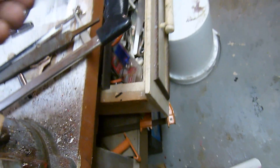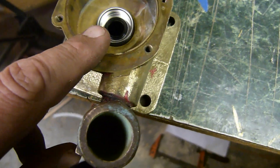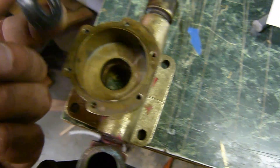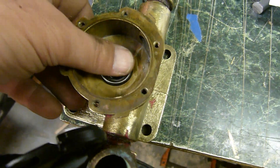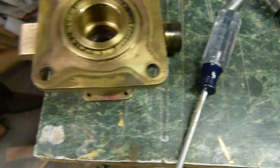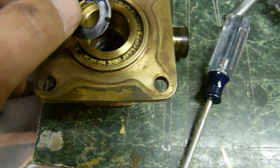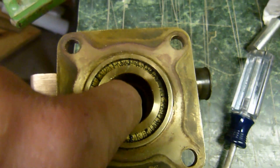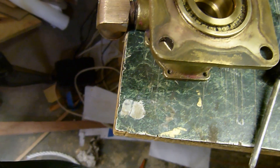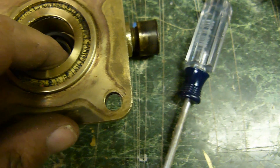Just used this brass fitting stuck in a board and then set a spacer up. I actually made two spacers. Now we're going to insert the seals. Here's the first seal and it just gets pushed right down in here — just push that right down in with my thumb. Get it lined up where it goes. So the seal's in on one side, and then you've got to put this in — it's a little spacer, and these little bumps need to be facing up. So in it goes with this little post pointing up on it. And we've got the other seal here — this time the lettering is pointing down, so it lines up the other way. And we can just push that right down in there. Get it in the right spot.